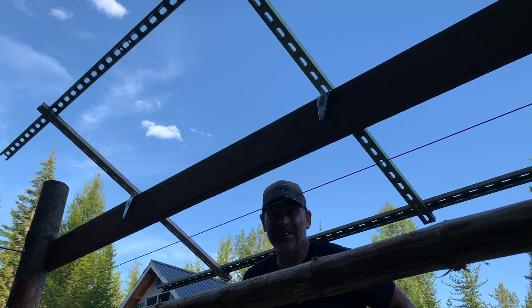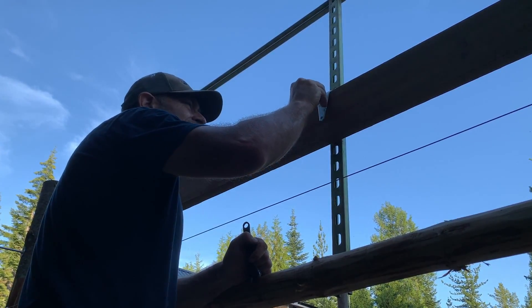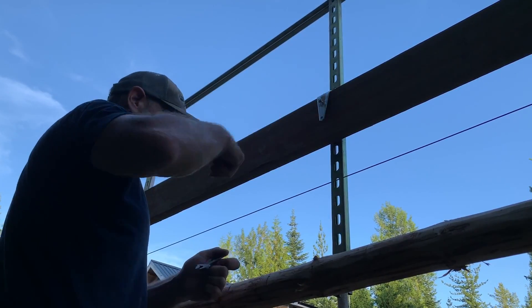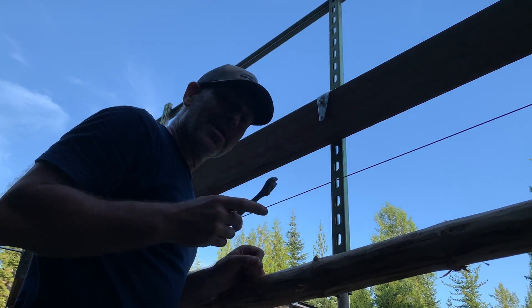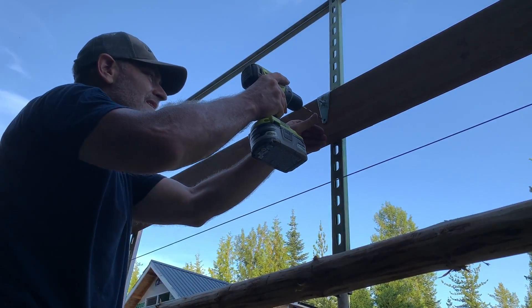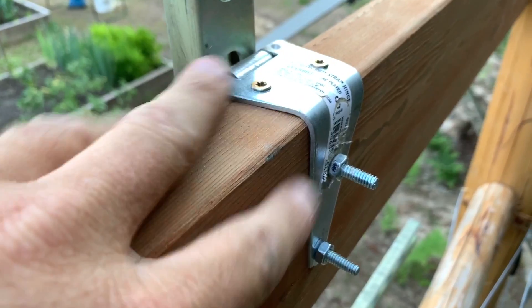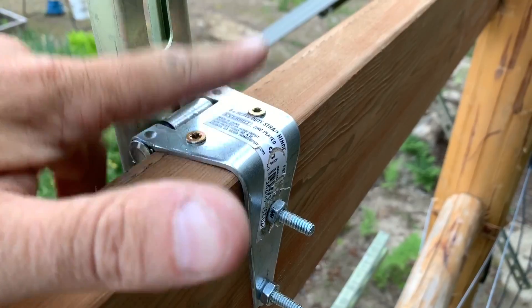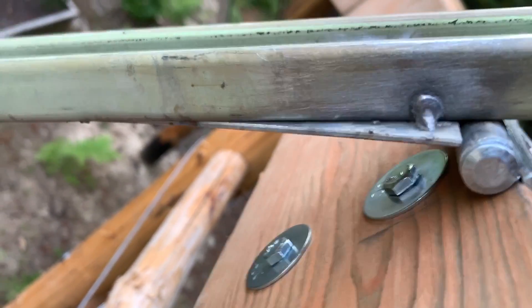I forgot to put the washer on — that's a pain. I'm doing one at a time on each one because this is pretty far away. When I get this one in there it'll suck it down nice and tight so I can get the other one drilled straight. Now we can drill the holes for the other ones. This is how the hinge is mounted to the two-by-six — these two bolts and these two screws up here were holding it in place. On this side you can see there are two bolts with big fender washers.